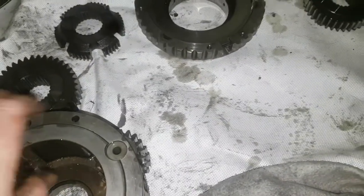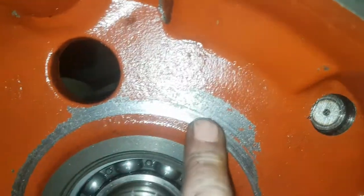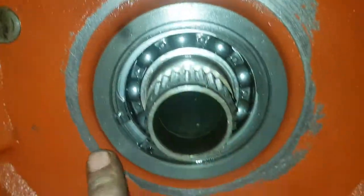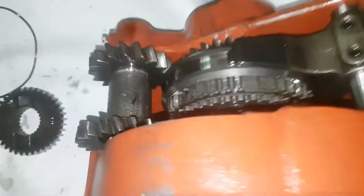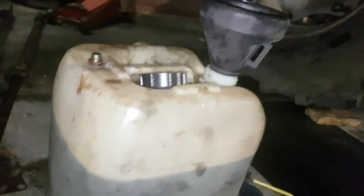So that's where I am with the Massey at the moment. I just had to get on the phone. You can even see here where it was striking the housing — that's okay. Other indications: when I drained the oil — I just drained enough to get out the box — it was quite metallic looking. New-looking oil, but it's bad.